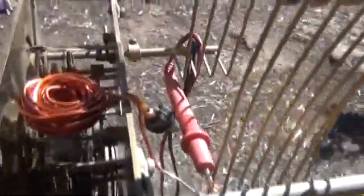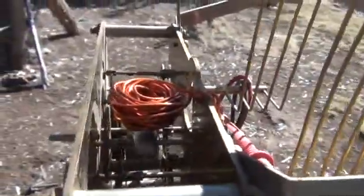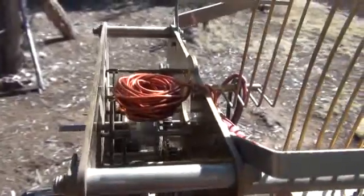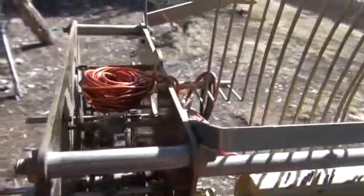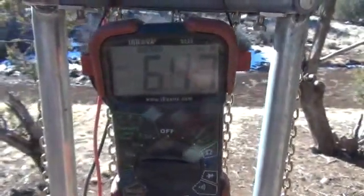I'm going to show you what's going on inside of here. You see that little spinning set of magnets with some duct tape hooked up to it. I have a little crude coil wrapped that's hooked up into my voltmeter, as you can see running around. That's all that's going on — just two little tiny neodymium magnets being spun by the weight of this mass object falling, generating electricity with a single coil at about five to six milliamps at 0.02 of a volt.